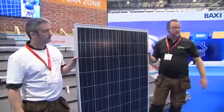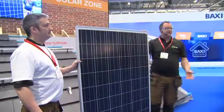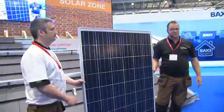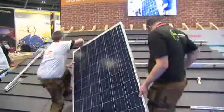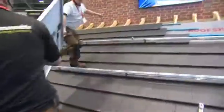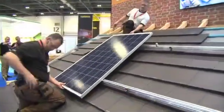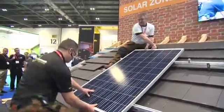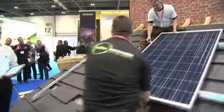We've fitted the bottom rail — you may have seen how simple it was, just a 13mm spanner and two hands to hold one end, and it's on in moments. Usually we'd fit a whole array of panels; this morning we're just going to fit one to show you. Nick's going to climb up the roof and we'll pass it up and clamp it in position. As for planning permission, no — not on a domestic installation, it's not required.